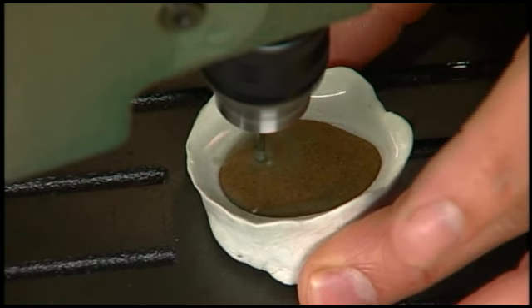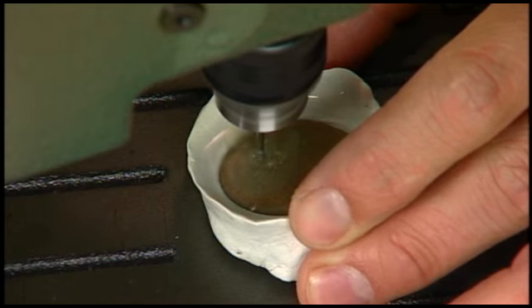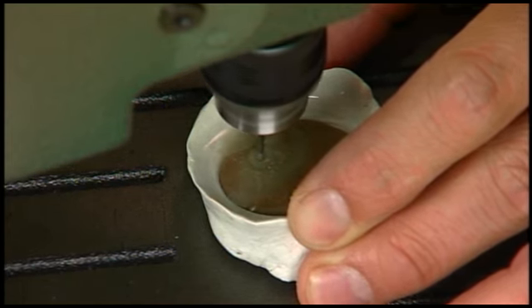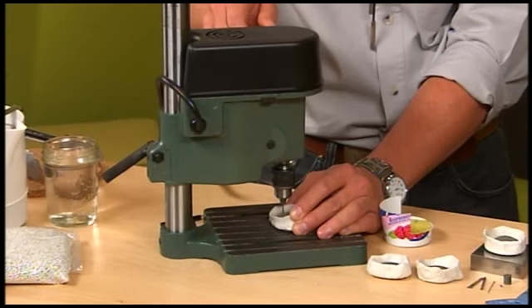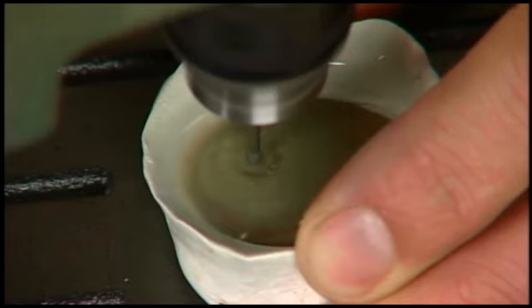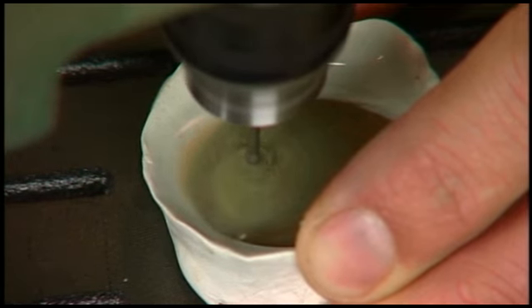Can you see that milkiness coming out of the hole? That means it's grinding. I'm going to use a light pressure and I like to pulsate. What I'm doing when I lift up is I'm clearing it from debris — there's little dust and things in there, so you're allowing it to get out of the way. That and I like to watch the swirl. Medium to light pressure.